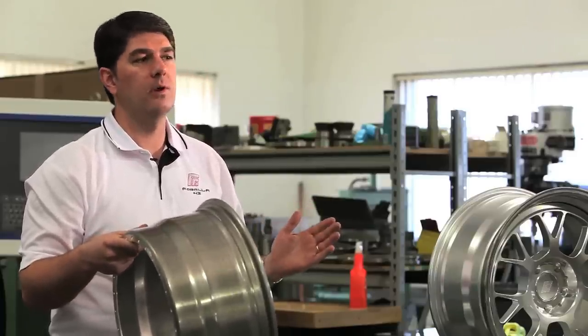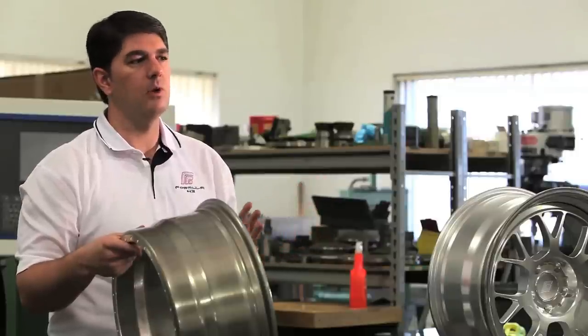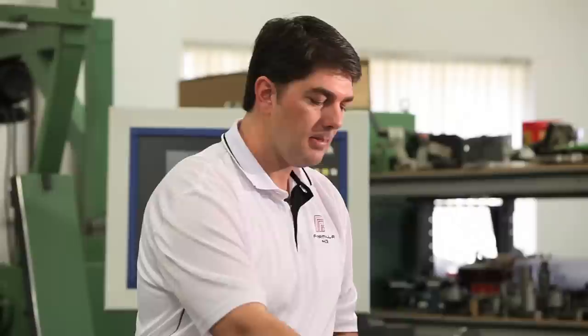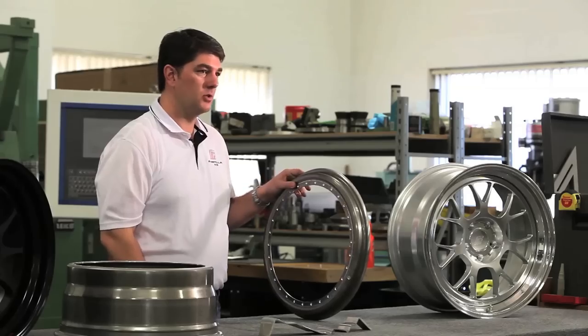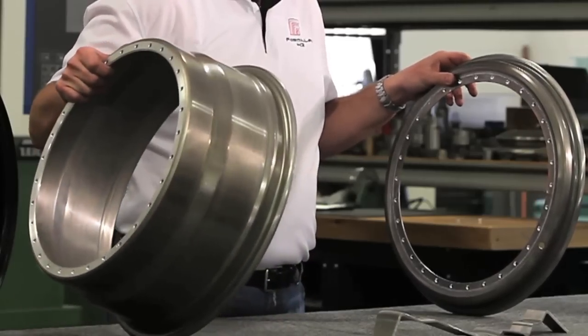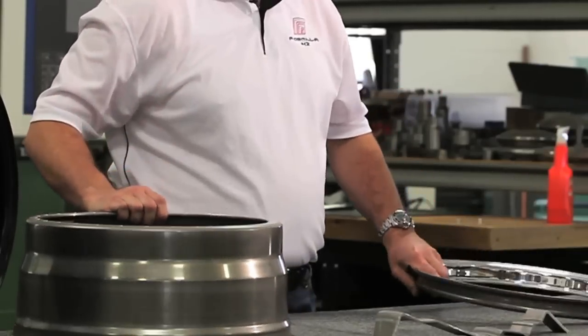We're using a very wide wheel with a high offset where a majority of that wheel width is going to the inside. We manufacture rim halves currently in 18 and 19 inch sizes. And you can see this is our smallest outer rim, and then some of our bigger inner rims can go up to 11 inches wide. Let's take a look and see how this is really done.